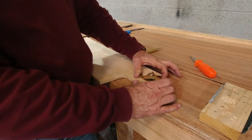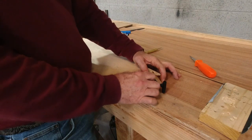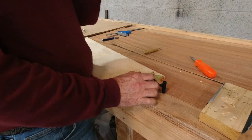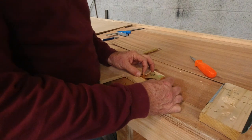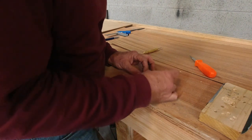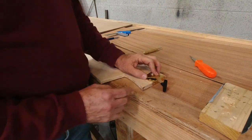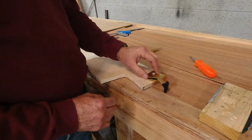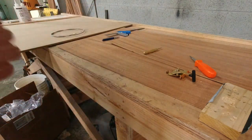When I push down on this to trim the nose down, the tab on the elevator is actually going to go up, which is going to make the tail go down, make the nose go up. So, all right, all of that. So now, I'll go cut this piece out, and then we can figure out where we want to put our mounting screws, and we'll get this going here.